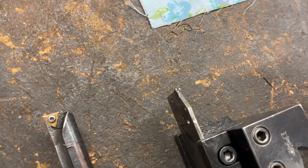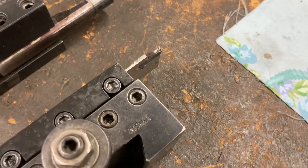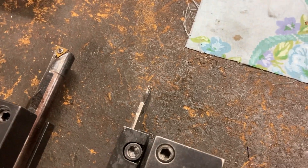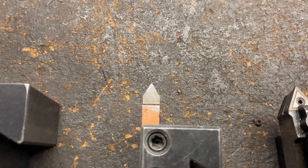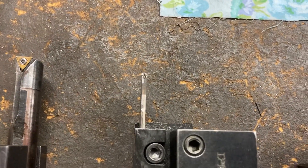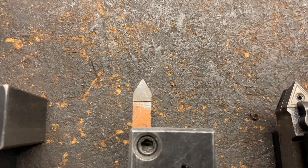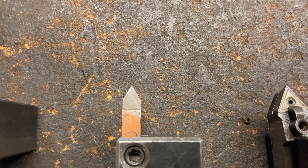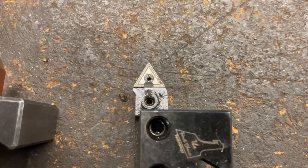Tool 4 is a cutoff grooving tool — the workhorse of this job. This bad boy removes all the material; it works hard and does a better job than I would have expected. Then we've got basically a threading tool that we plunge into the center of the groove to get way down inside. Because the grooving tool has a square cutting end, we use this to remove the square cut at the very bottom and create clearance for the final tool to cut the V profile to size.